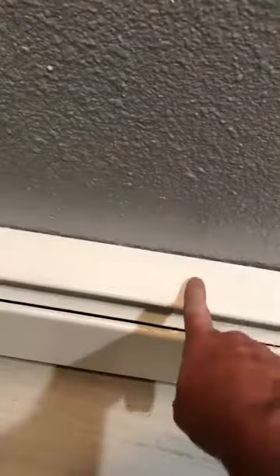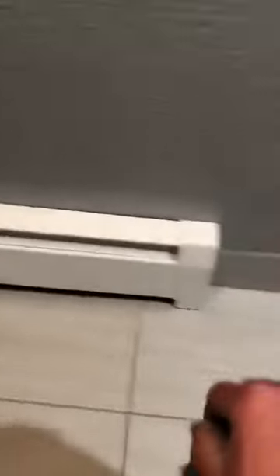We repainted the baseboard heat unit there — boy, that looks beautiful. You know, guys, these right here, you can take them all apart. You just sand them with some sandpaper, clean them off really good with some acetone or thinner, and then just rattle can them, and they turn out beautifully. Most of these pieces all come off. This piece is stuck on pretty good, but you can just run some tape along here, sand it, and paint it right where it is with a rattle can, and they will turn out fabulous, as you can tell.